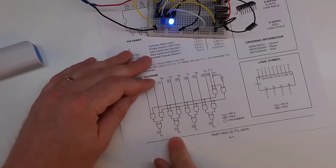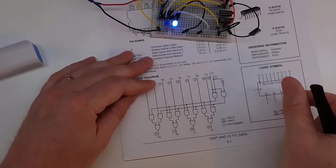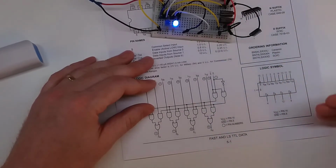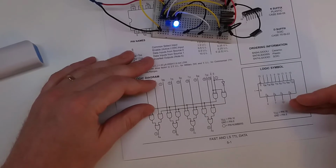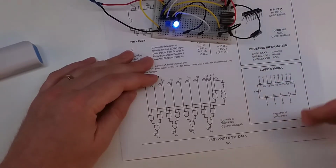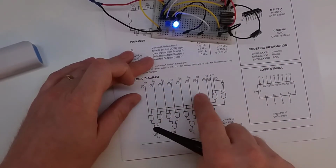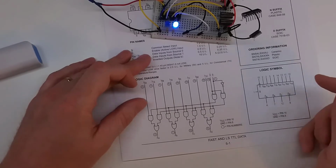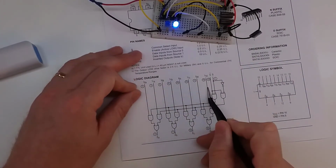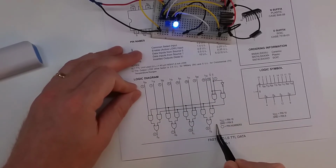Now this might be used as a control switch today. So if you think about, maybe you've got a multi-position switch and you need to know one of 4 positions, but then you also have a toggle switch up and down in order to set 2 different ranges. So for example, in one position, you'd be able to read the first 4, and then in the other range, you'd be able to read the second 4, all with that same control knob. So there's definitely some practical uses for it today. Again, we've got 8 inputs plus the switch, and then that produces just 4 outputs.